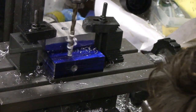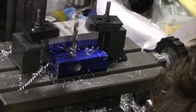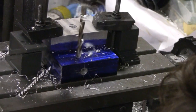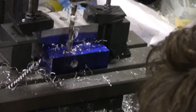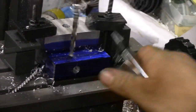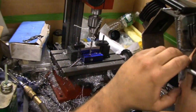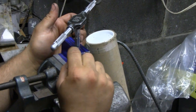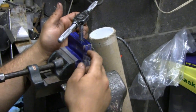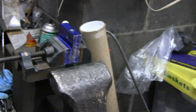It's going to be the best oil pump on these. You gonna patent that? Threading this hole here for an eighth-inch pipe plug. The only reason this hole is here is so I could drill the long hole all the way through and I just put a plug in it. The actual inlet's going to be there. You want me to go get the tapper or straightener? Well, does it do pipe thread? Let's go try now.